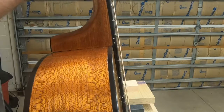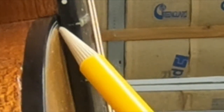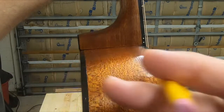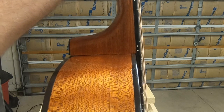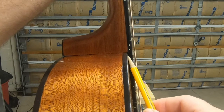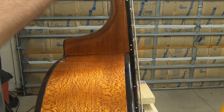I'm a little concerned this may not show up well — I'll try to zoom in a bit more in editing. What I noticed was right here there was a gap; this was a little bit higher than the body. At first I thought maybe it didn't seat totally, but when I look at the back this actually sticks out a little bit longer. I started thinking about it: when they send out this kit they don't really expect you to thickness the top and the back, but I chose to. What happened is I took wood off the entire top and back, and that created a gap — at one point I could actually see through it.